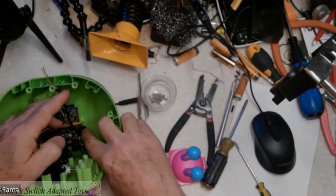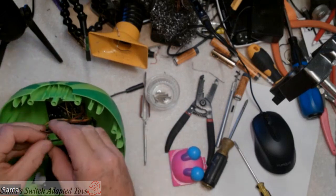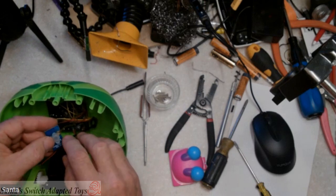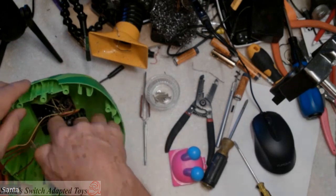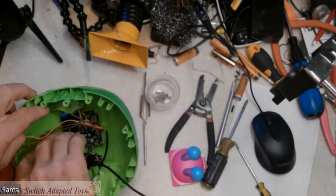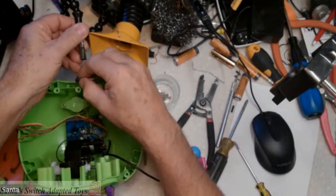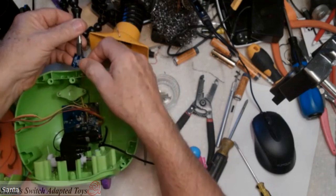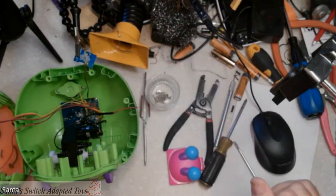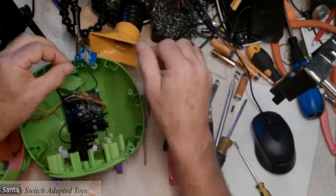With that amount of cable from there, that gives us some room to work. The circuit board is floating, and like I say, we've got two solder points on the top there. Let's tighten up this knot. Because this is a roly-poly thing — it's all round — it's a little awkward to hold everything together. But if I can pin this into the third hand, we've got our soldering iron turned up and we'll add these to that connection there.